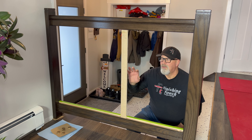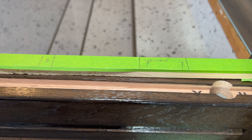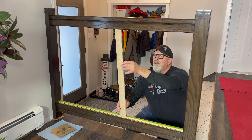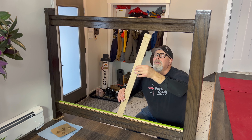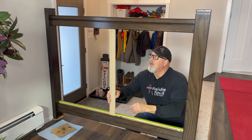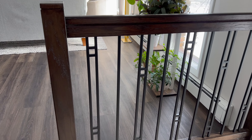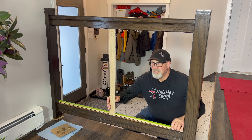For this one, exactly the same kind of pattern — I'm going to go from a double to a single and a double and so on along the railing. Again, I've made up a story pole, and I've made sure ahead of time that the H-style baluster is going to fit after the railings are glued and screwed in place. I'm going to stagger the pattern a little bit, and I'm sure it will work out.